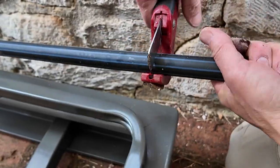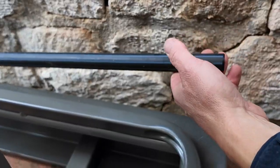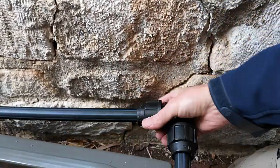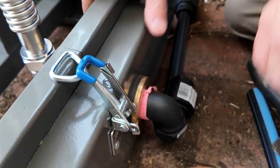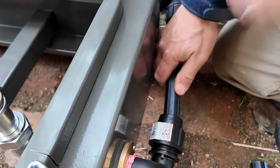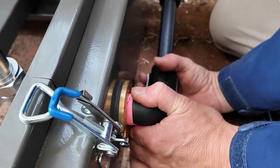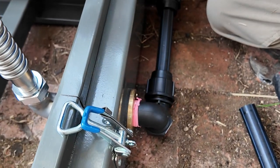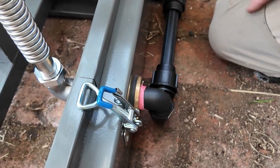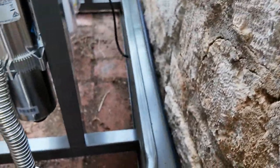Move the unit out a bit, I'm going to cut here. What I'm going to do is get the old pencil sharpener, put him in there - it's de-burred. Blue line fitting again, push it in, line them up, come down to the unit here, loosen the fitting off a bit. Wind that up nice and tight until they're firm. Put the unit back down on the ground - this fitting just touches the ground a little bit so it will bend up a fraction, but see how simple that is. That's your return line for the unit going back to the house, runs back around behind the unit. This unit is only a temporary install - the client's going to move this later on once they've done their reno on their property.